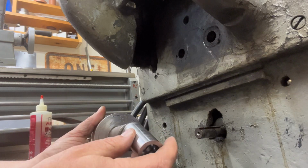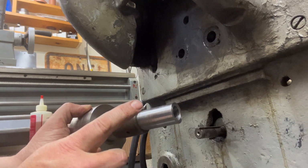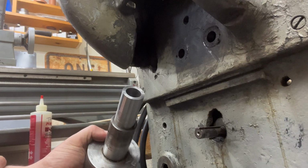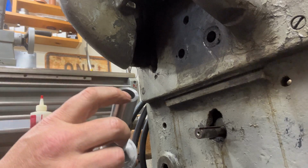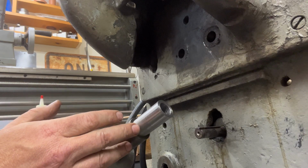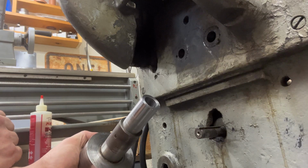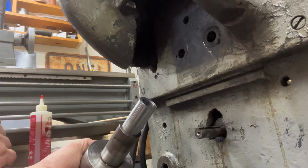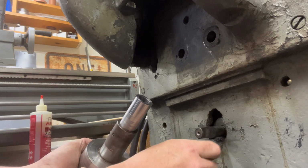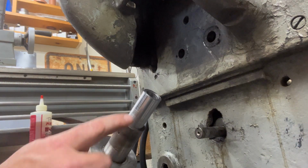But if anything, as I'm looking at this, I can get a good start here. What I remember from the last time we've been pushing things through bushings is the interior dimension gets smaller. So I think the first thing I'm going to do is press this into the pulley, then bring it back to the lathe, measure, and see if I need to re-drill this again with a 3/4 inch drill to get it back to the proper size. And then we might address this with some emery cloth or a file as it's running to just take it down a little bit. Let's see how that goes on the press.